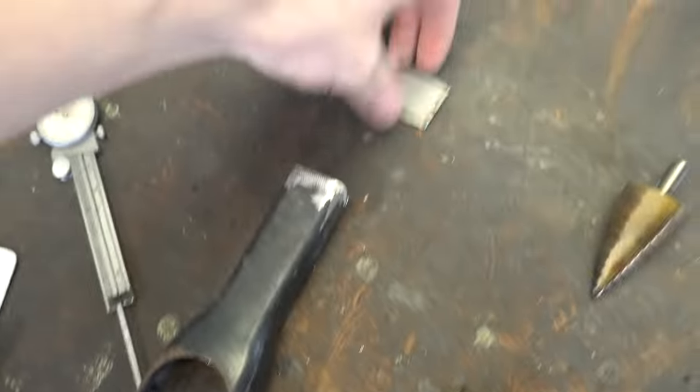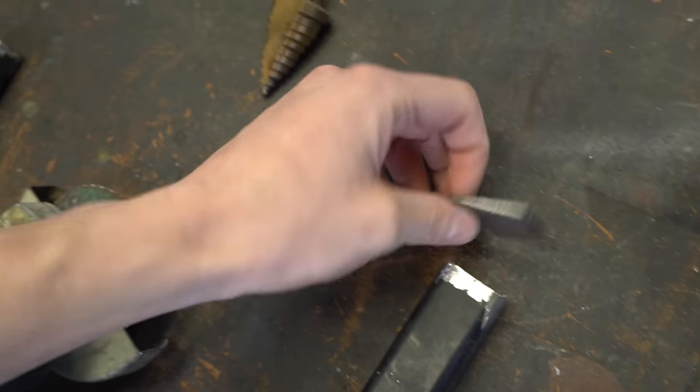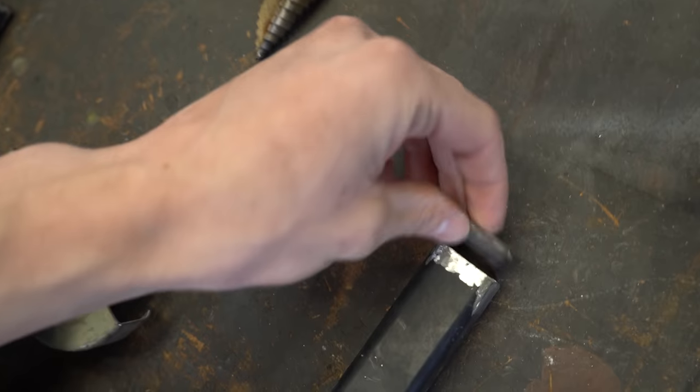I went ahead and cleaned off all the paint, got all the burrs off these - they're looking really good and ready to be welded. The next step is drilling those holes with the step bit. I got my little pieces for each end cut out and ready to go. What I'm going to do is drill the holes, weld them on just to tack them, then put the piece in to center everything out with the bungs, and weld everything up so nothing moves. Metal actually transforms and bends a little when you weld, so we're going to tack each side, put those bungs in, and weld the bungs up.